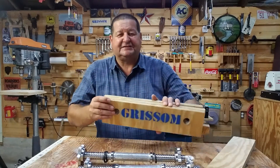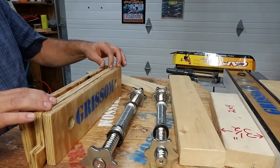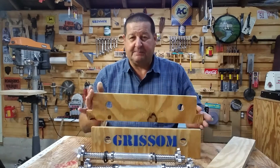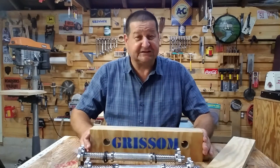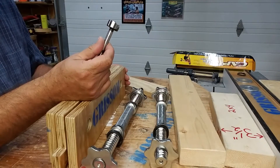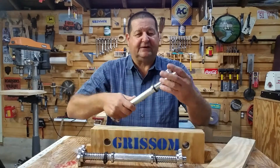This first prototype is simply three pieces of plywood with holes drilled in both ends, measuring four inches by 16 inches long. The middle section has a one-inch notch on each end — I'll show you what that's for in a moment — which makes that piece 18 inches long. The front vise jaw is also 16 inches long. All you need to complete this project is to cut your material to dimension, then use a one-inch Forstner bit to drill the holes in each end, since we're using one-inch Acme threaded rods.